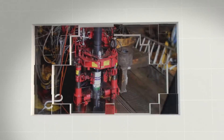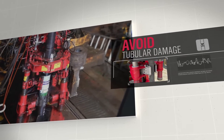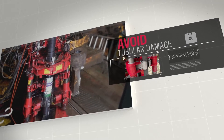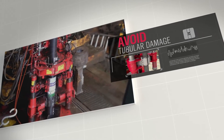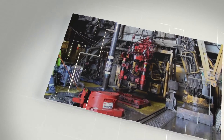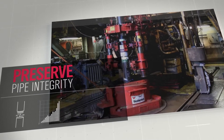We use power tongs that avoid casing damage and deformation, with features such as a unique gated rotary that evenly distributes gripping forces and a free-floating backup that virtually eliminates shearing and bending forces. Our tongs and other tools also use the Weatherford micro-grip system to minimize die marks on corrosion-resistant alloys.